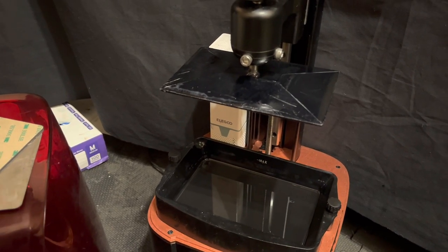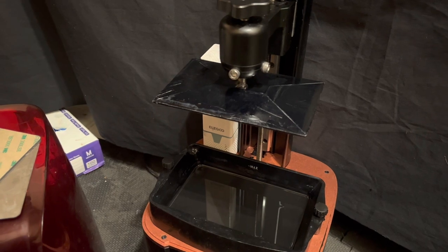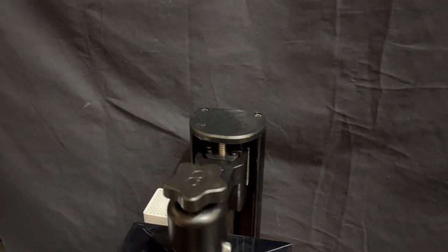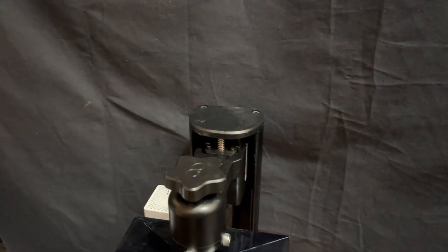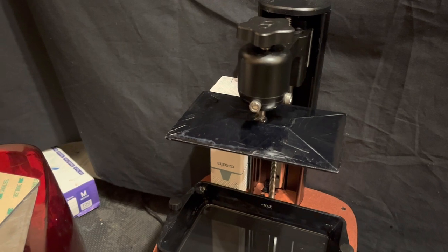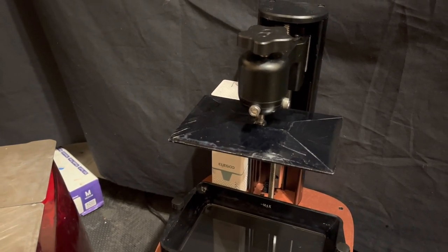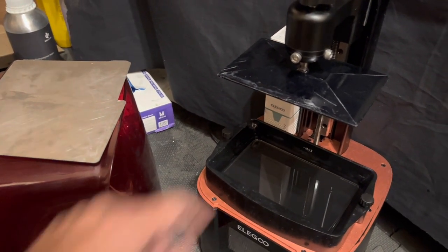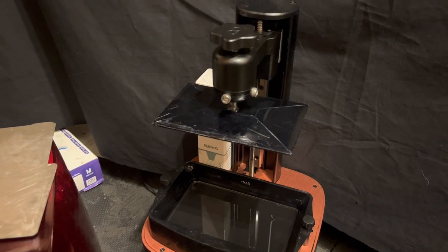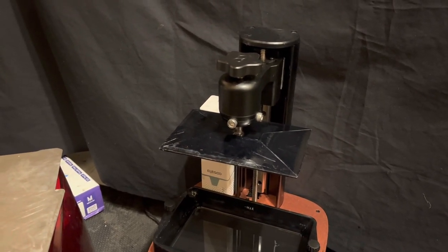Fortunately I managed to stop it before it did any damage. I did a bit of reading and found that resetting the home position doesn't work as expected — you have to physically modify a piece of plastic up top that hits a stop switch to prevent the build plate going down too far. I set that up but couldn't get anything to print properly, had loads of print failures, so I reset everything back to stock, removed the spacers, went back to printing directly on the plate, switched away from the water washable resin, and fortunately everything started to go well again.